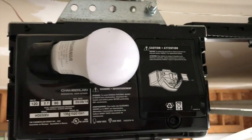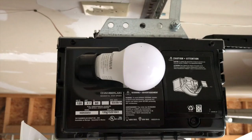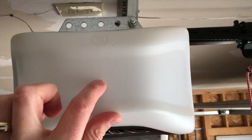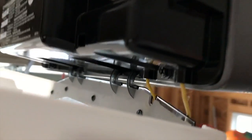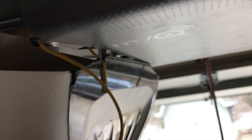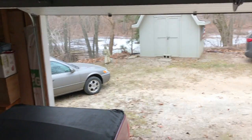After the battery cover plate is secured, before getting off the ladder, verify that both light bulbs — one on this side and one on the opposite side — are properly secured. Then carefully close the protective lens on this side and the opposite side. On the opposite side, before closing the protective lens, note the two yellow wires — make sure those are in good condition with no signs of stress. Those are supposed to be hanging out, so make sure as you close the lens those wires are out.